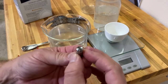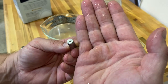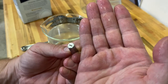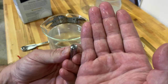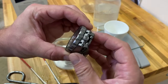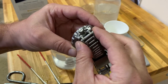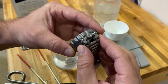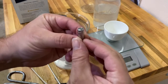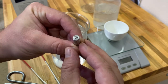This is an actual bar remnant, 316L, exactly as it came out of the lathe. I faced it and laser engraved it this morning using the exact same program we used to do the crowns. I'm not seeing any type of rust or discoloration. It looks like this stuff has had a chance to dry — starting with the watch, you can actually see the salt residue on the bezel right there. Pretty salty — 50 parts per thousand — but I don't see any rust or discoloration that would lead me to believe there's a large amount of iron on this. On the bar end, you can see white salt residue all over the edges, but no rust indication.